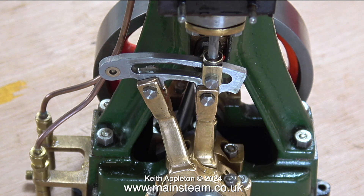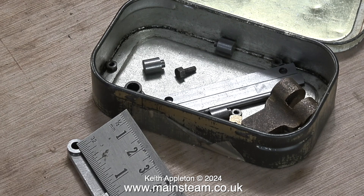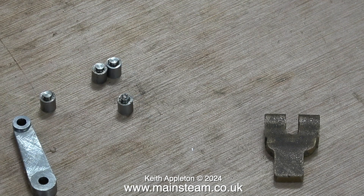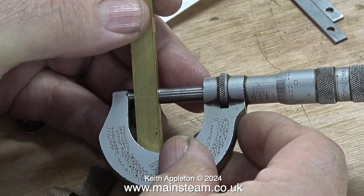The expansion link slides very freely all the way across the die block at any position of the crankshaft, and this is what I need it to do. Some of the components are completed and others are not — most are just part-made. I'm checking that all the part-made components have been made correctly. There is an error though: if you look at this drop arm, it's wrong. The hole at one end should be smaller than the other, but it's not a big problem — I'll fit a phosphor bronze bush to repair the error.